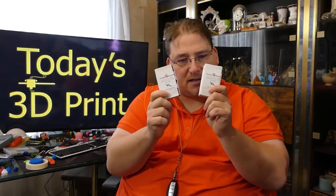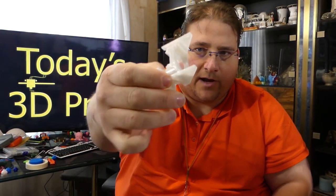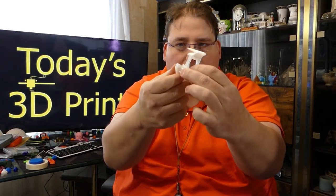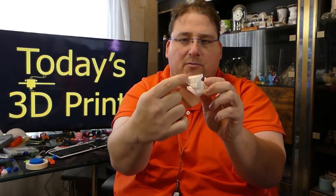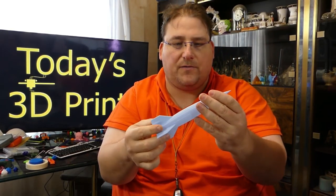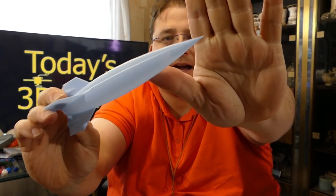Things like ends for my rockets, launch lugs, motor casings — whatever I can figure out to use nylon and polycarbonate for. I've upgraded my hot end replacement design to now fit the Micro Swiss, accommodating the 30mm fan. It also has two mounting plates for cooling fans, because when I tried printing too fast, one side was spectacular while the other lacked cooling. Two fans let you run each at 50–60% — same airflow from both sides but quieter.